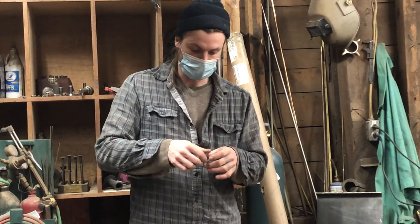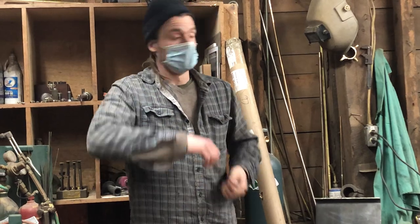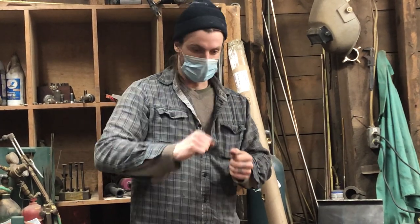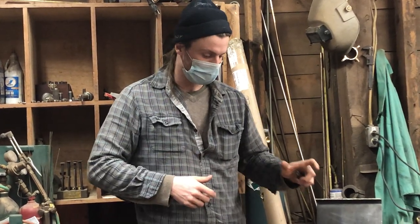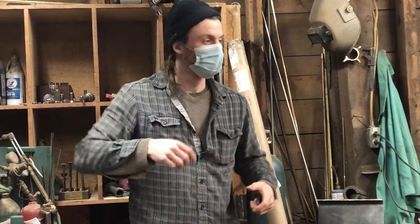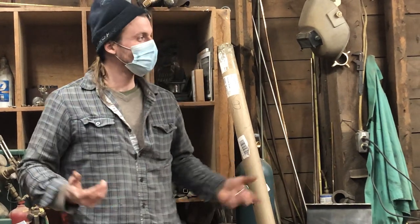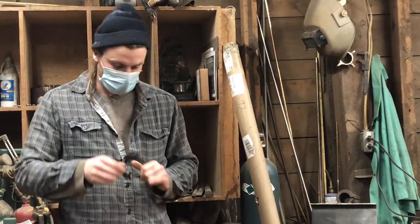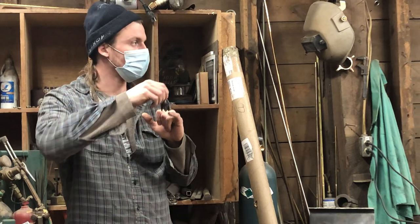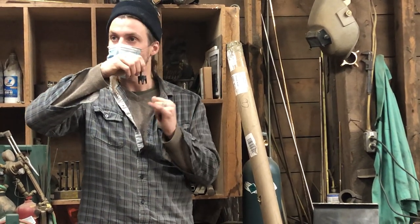One thing that is important to be cognizant of, I'm sure you guys have all picked up a bung cutter, chucked it into a drill press, gone to run it down on a piece that you haven't necessarily clamped down, and it skitters, and you're like, what the heck? And when you have one tooth of a bung cutter that's lower than the other three, right?